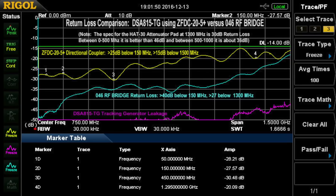I've been using a MiniCircuits ZFDC-20-5 directional coupler as my essentially return loss bridge. The yellow line on this graph shows its results. It's okay up to about 450 MHz, in the neighborhood of the 30 dB spec. Above that we see some degradation as we go up to 1295 MHz at minus 20 dB, and actually a little worse than that because of ripple. So not the ideal thing, but still useful. But the new one is much better, which is the blue line.